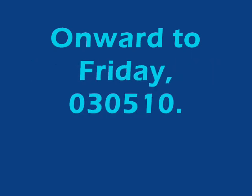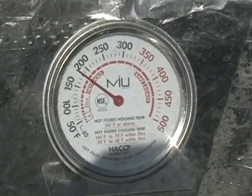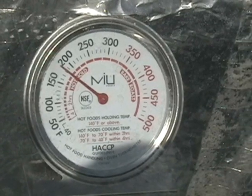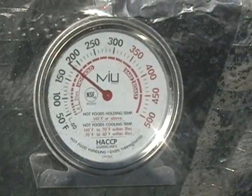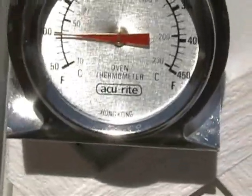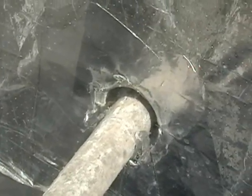I've got an internal temperature of 154 degrees. I couldn't resist coming out for one more update — it's about 1:25 in the afternoon. The reading is climbing: 152, 153, 154, 155 degrees — that is the highest yet on the bread box. The ambient temperature is almost 100 degrees, so it's 55 degrees more inside. Looks like the moisture problem is pretty well taken care of now too — I don't see any drops at all, though I still see some condensation underneath the tank. I left one joint open to let air in, and the joint where the T&P pipe goes out, so air can circulate.